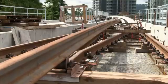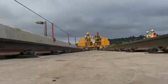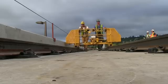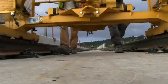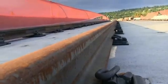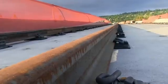But before the rail is clipped in place, it needs to be de-stressed, which will allow the rails to expand and contract the right amount for the hottest and coolest temperatures expected during operations. The twin hammers of this device send a shockwave through the rails that you can hear if you listen closely. That shockwave eliminates any tension that may have been created as the rails were pushed into place.